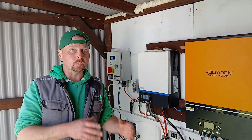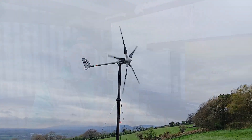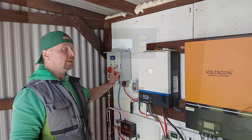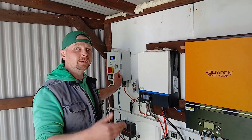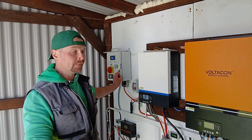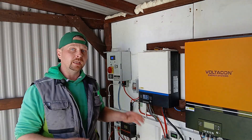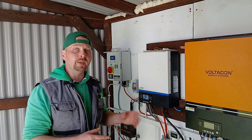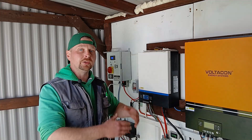If you're watching this and you'd like to set up your own wind turbine at home, here's what you need to know. First you'll need the turbine itself — Istabreeze do make good quality turbines, but like all machines they need to be taken down for maintenance like once a year: just bearings, maybe a slip ring, a few little bits and pieces — not expensive. You'll also need a control unit because the generator inside the turbine produces AC electricity. However, it's wild AC — it fluctuates up and down, usually less than 80 volts — nothing like mains, so you can't plug them directly in. You'll need a battery bank running DC, and that's what the control unit does: it rectifies the current across to DC and charges up the batteries. From those batteries you can use an inverter to run your appliances. Basically the wind turbine makes the power, sends it to the batteries where it's stored, and from there the inverter turns it into usable mains electricity.